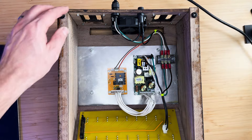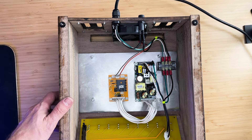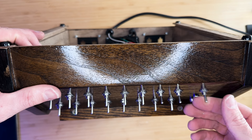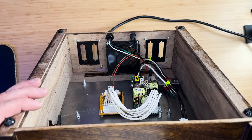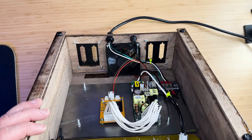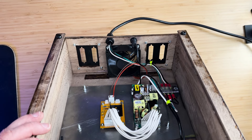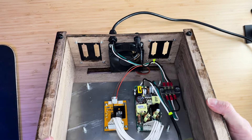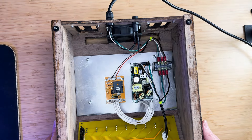We're now ready for a smoke test. Let's plug in the cord and power on the power supply using the switch on the switch panel. The fan powers on and blows air out of the enclosure, which is exactly what we want. I may reduce the speed of the fan in the future as it's fairly noisy. It's also a good idea to double-check the voltages coming out of the power conversion board to ensure they are positive 5 volts and minus 9 volts before continuing.